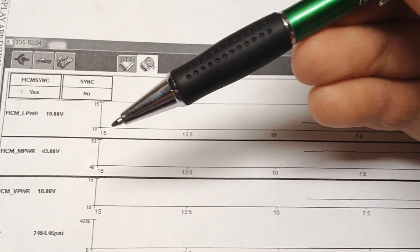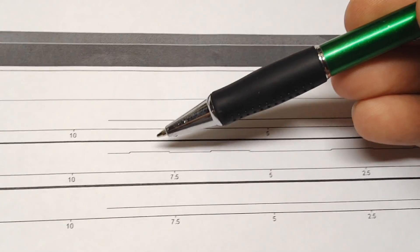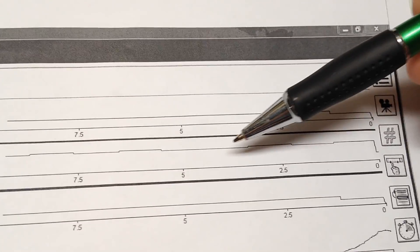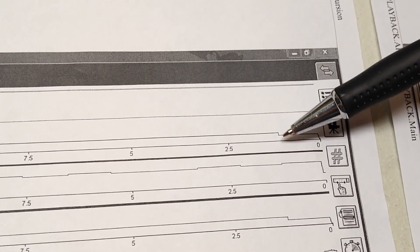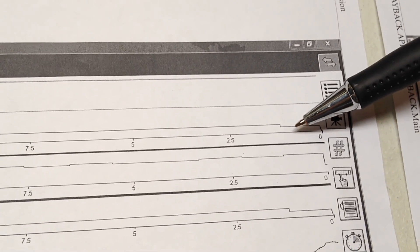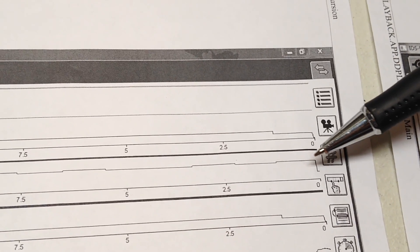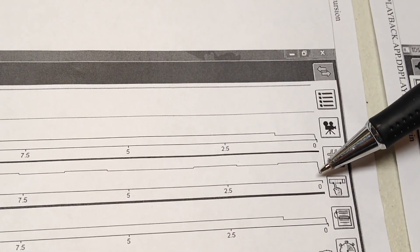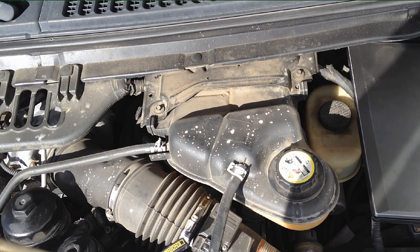As you can see, we're at 47 to 48 volts with just the key on. Then once I start cranking — because of the voltage drop coming into the FICAM once I start cranking the engine cold — you can see that M power for the FICAM drops out of the sky to 43 volts and kept dropping from there.